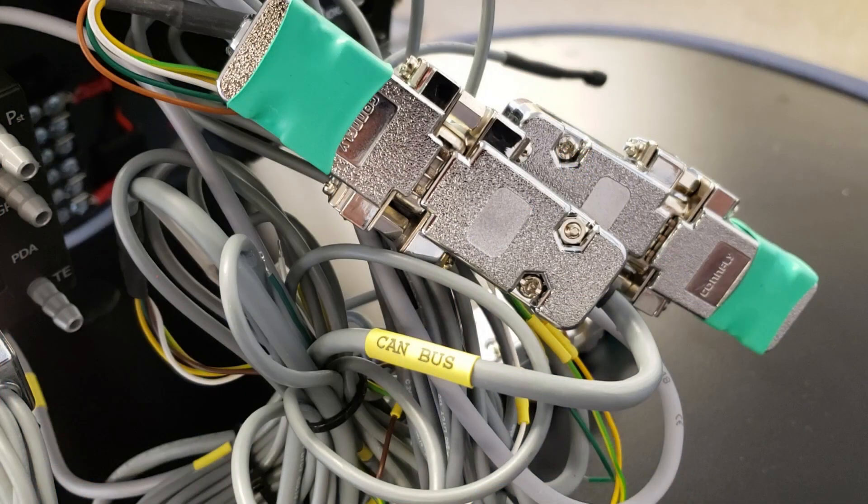The instrument has a high precision digital pressure sensor which samples at more than 100 times per second. The LXNAV S100 can be expanded with one or more repeaters by a CAN bus. This allows both pilots in a two-seat glider to have independent control of all functions of each unit in the front or rear seat.